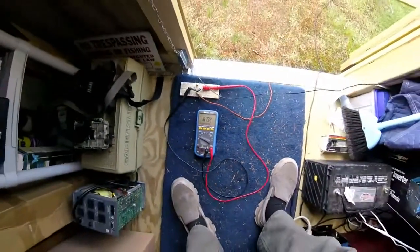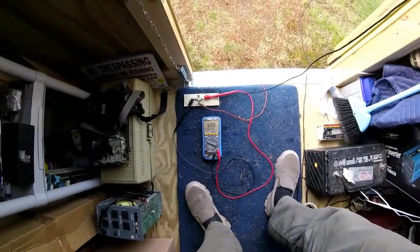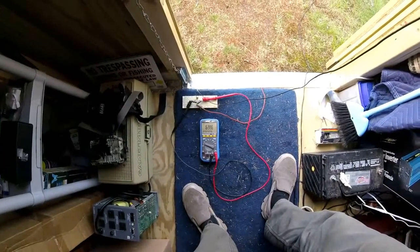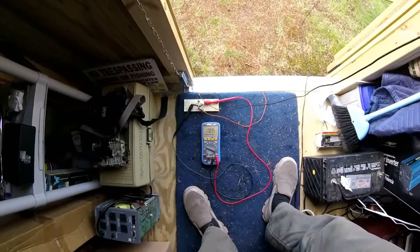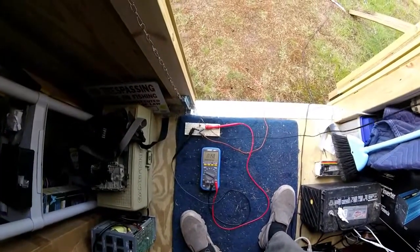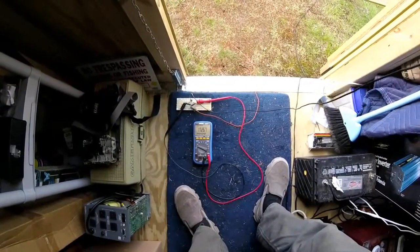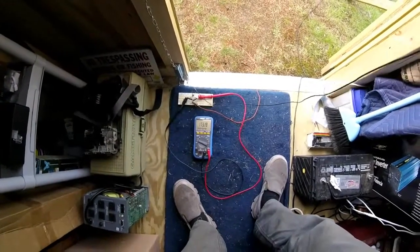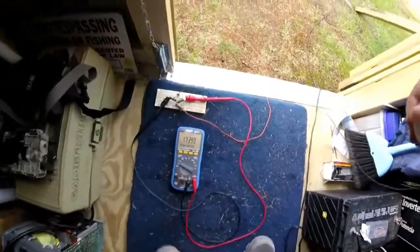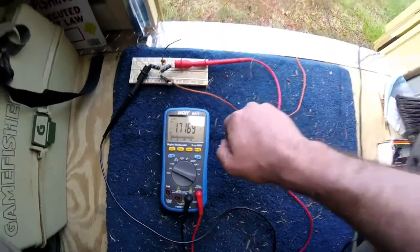I'll stand up. I don't know if you can see that on the camera, but as I stand up fully extended the voltage increases faster and stronger. It's interesting. My guess is it'll probably go as high as the capacitor voltage, because I'm sort of isolated from the capacitors with the diodes. Bending back down is going to reduce the amount of voltage — see, it's dropping. All I've done is bent down.